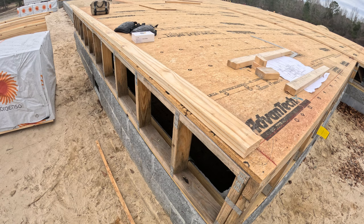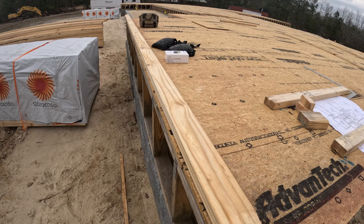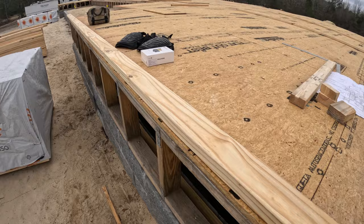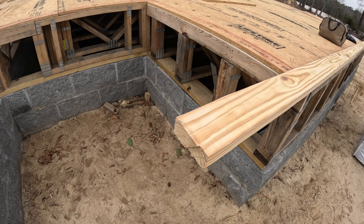And wall plates, which down here have to be southern yellow pine, where the studs can be spruce. They do that for supposedly the uplift strength. Yellow pine is stronger than spruce, but the lumber itself is harder, and it's usually not as straight and has more knots. And the ends on any dimensional lumber are not always square, and the lengths are not all the same. You can even see the little hook that's in there, but if you look at the end of this one, it looks like a beaver chopped it off. So you want to make sure that you square all the ends when you do them.